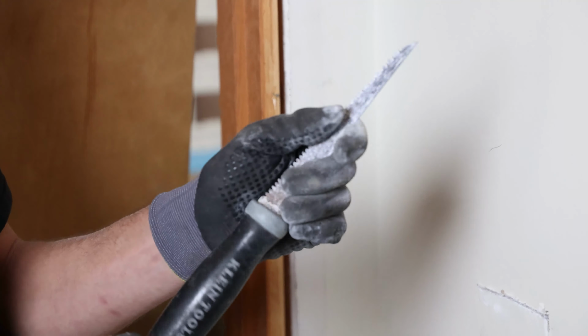Now we need my switch legs. Primary lighting is gonna go right through the center of the ceiling here. We're gonna have a total of three wafer lights. I'm actually not even gonna cut this wire this time. I'm gonna run the wafers continuously and I'm gonna label them with Sharpie everywhere I think they're gonna go. I'm gonna give myself the highest likelihood of success. I'm gonna leave some slack. I'm gonna label my wire. And if the missus changes her mind, guess what? Base is covered.